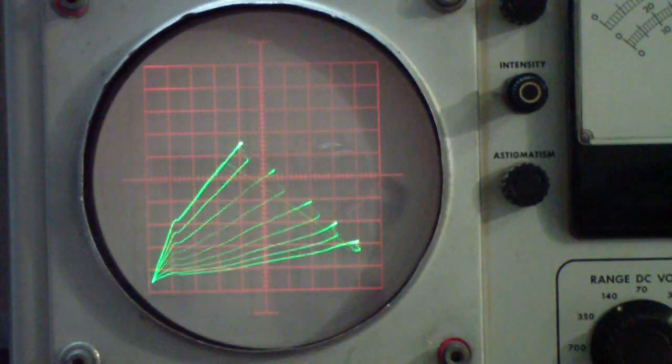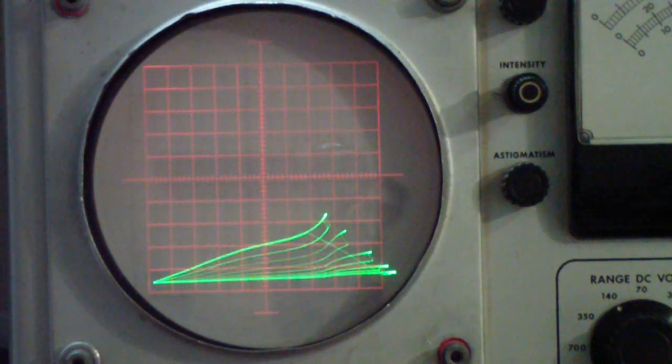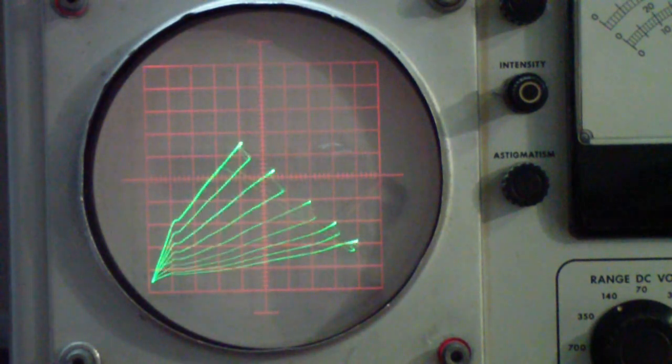So, what we have put here on the 570 are a pair of 6A8 GTs. This is the one on the right as you look at the panel, and I'll show you the panel here in a second. And this is the one on the left. Now I'll also explain how this is set up, and if you have watched my previous video on the setup of the 570, I'm following some of the guidelines that I put forth there. As I pointed out in that video, there is no tube chart for a 570. You kind of have to make it up out of using tube manuals. But at any rate, you notice that the gain of this one is substantially lower than the gain of that one.